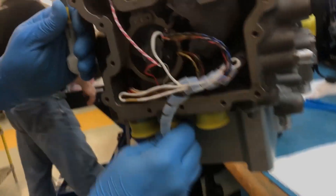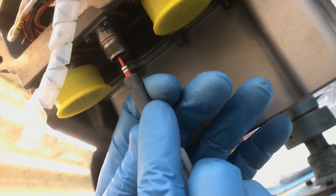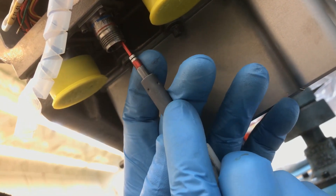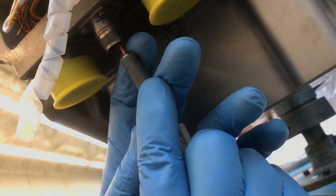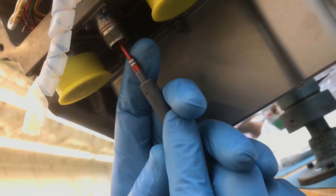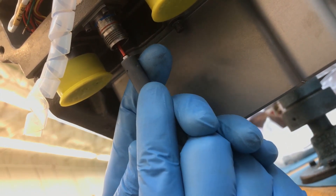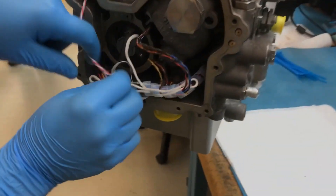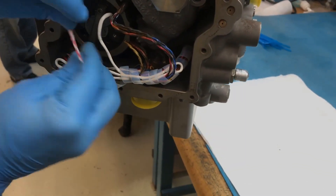The use of a pin push tool ensures that the pins are properly locked in place. Test the pin continuity and resistance with an ohmmeter. Pin 1 to 2 is open circuit. Pin 2 to 3 is open circuit. Pin 1 to 3 resistance is 0 to 0.5 ohms. Pin 2 to case resistance is 500 kilohms to infinity. Pin 3 to case resistance is 500 kilohms to infinity.